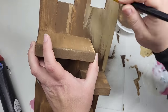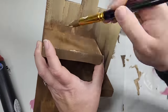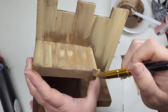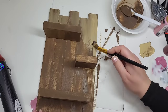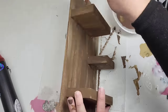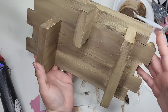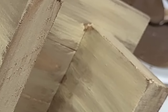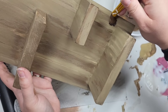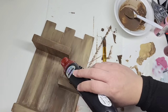This khaki goes so well with this and it also blends really well having an acrylic go over top of a chalk paint with some water. I don't even think it took me 10 minutes to paint the entire project. Be mindful that if you use wood glue it will show through your paint, so when you're going heavier on the paint make sure you're covering up the wood glue in those sections so you don't see the stain. These two colors blended together so nicely. Look over it and see if you have any little holes or spots and blend before everything completely dries.